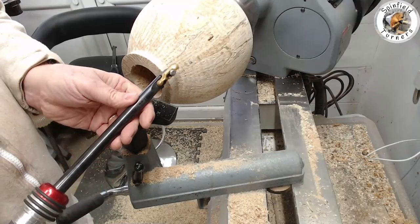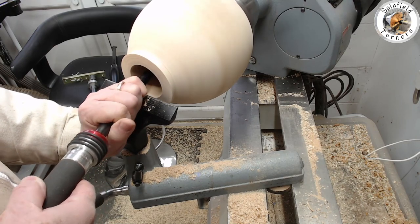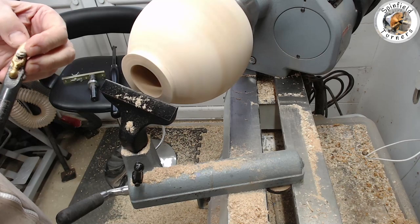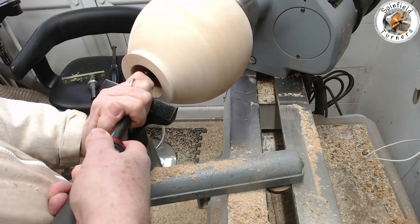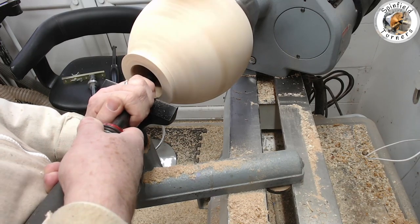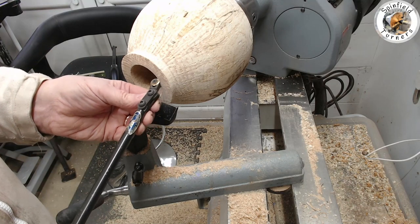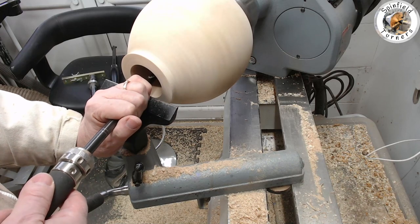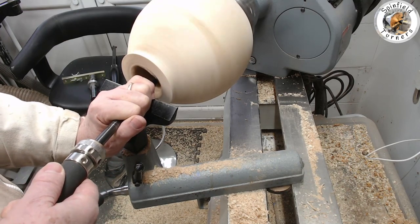Hollowing isn't really a spectator sport because there's not much to see, so I thought I'd try all my different tools. This is the Woodcut one — I'm not too sure about it, sometimes I have really good results and sometimes I struggle. Today I'm struggling. The shielded cutter seems to be clagging very easily with the soft wet wood. I've had some really good results with it with a slightly more open form but today I just couldn't get on with it — it kept clagging up so I decided not to bother with this one today. I've swapped to the Crown articulating tipped shielded cutter which is high-speed steel, and I find that this works quite well — more consistently than the carbides. It clears the wet shavings very well.